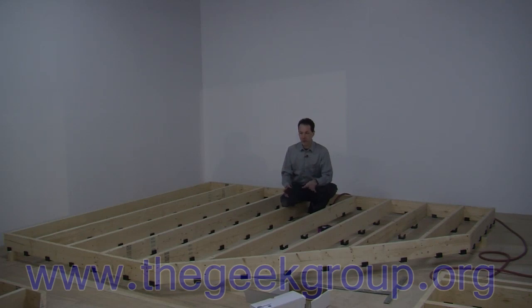The first step on building our isolation booths is we use 2x6 framing construction. Now, a lot of guys talk about using stringers versus not using stringers. Stringers are short pieces of bridge between, just like 2x6s in between, that are spaced throughout. We didn't do that on this because these 2x6s are going to be completely rigidly attached to multiple layers of floor above, and they're going to sit on the floor on the U-boats, so they're really not going to be vibrating back and forth. We don't really have any big worries about that.